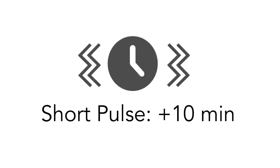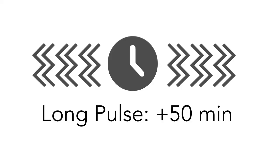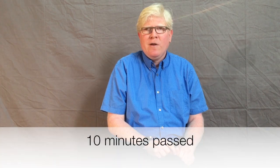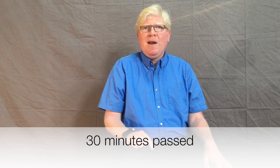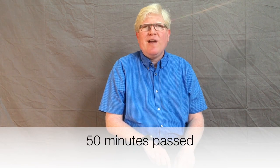Let's start by learning how to read the major increment, or how many tens of minutes have passed. For every short pulse, we will add 10 minutes to the time, and for every long pulse, we add 50 minutes to the time. For example, if we receive only one short pulse for the major increment, we know that only 10 minutes have passed the hour. If we get three short pulses, then we know it's 30 minutes past the hour. If we get one long pulse, then we know that 50 minutes have passed the hour.